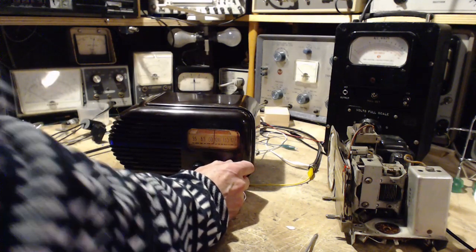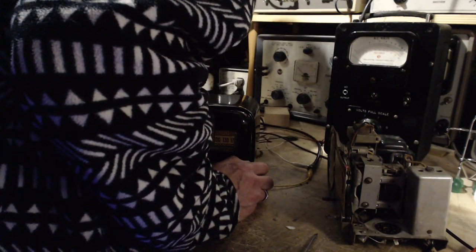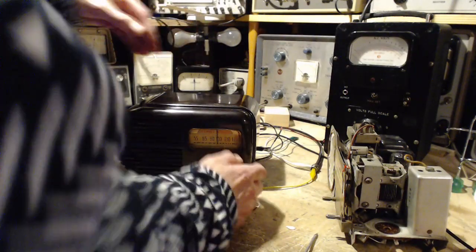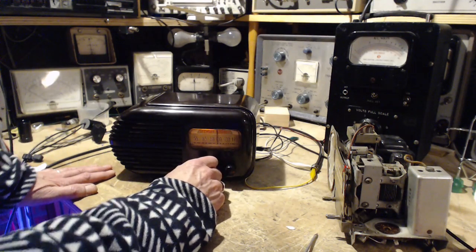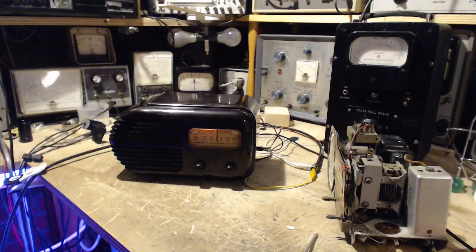Okay, we're ready. Now I'm going to get rid of that hum. The hum is probably related to the power supply on my bench here. The ungrounded power supply. The whole thing is floating. Right? Ungrounded power supply. Okay, so the lights, that's a little more tame. These usually do have fairly low lighting, really intended for nighttime viewing. Okay, the hum is gone. Okay, we were right around 8. Were we not?